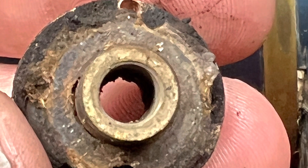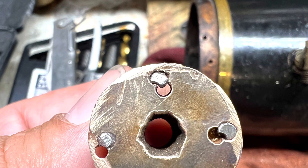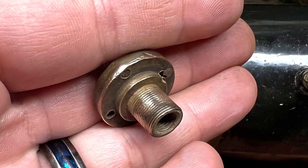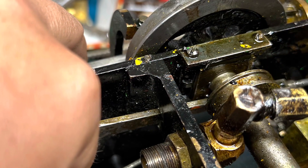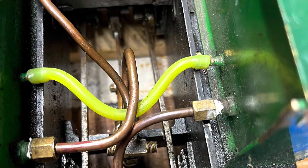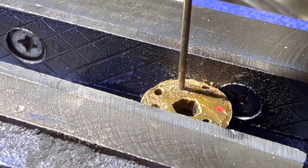I eventually triumphed and got it out, and as you can see here the gasket is in dreadful shape. I then had to deal with the leftover studs, drilling them out and flattening them, and then reinstalling the super heater. While I had the boiler off I also addressed many of the plumbing issues and some clearance issues with the eccentrics rubbing against the frame. I replaced the low-hanging water inlet and some worn-out tubing. Off to the drill press, I drilled out new holes and tapped them for different screws.